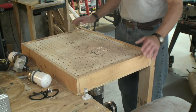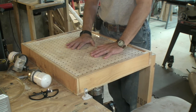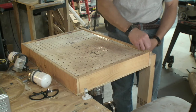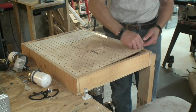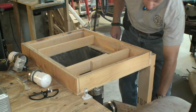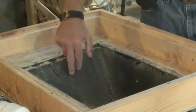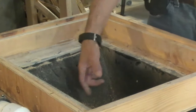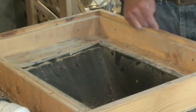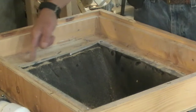Let's talk a little bit about the sanding table. I built this a while back and it does a decent job of holding sawdust down. It's a very simple table — you've got pegboard for your basic top, and underneath is just your basic framework. These are supports that need to be permanently attached, and there's a plastic dust collection hood here in the middle. That goes down and I hook my four-inch intake exhaust to my dust collector, which is over in the closet behind me. These edges are all caulked here, and underneath is caulked as well.